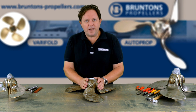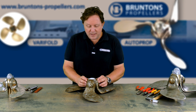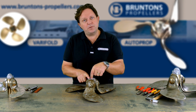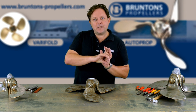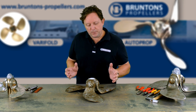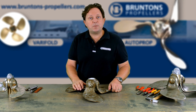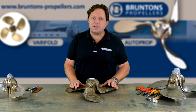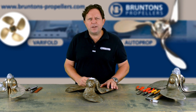The final part before you take the propeller off is the prop pulling tool. You can actually make one — it's a metal plate that sits on the back of the prop, with three holes in and a central bolt. You wind it on so you're pulling the prop off from the shaft end. Be very careful when you're in the yard using prop pullers. The blades on an Autoprop need to move and swing freely, and if you have any load on the blades, you can actually damage the mechanism that allows them to feather.